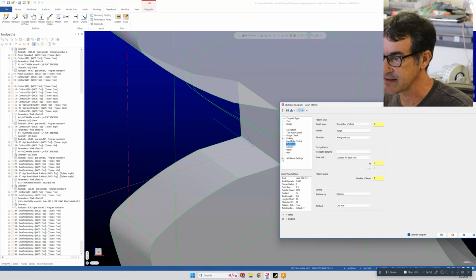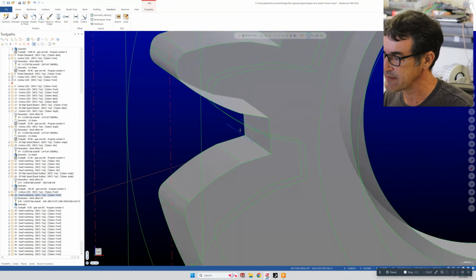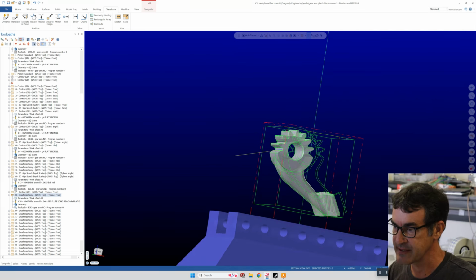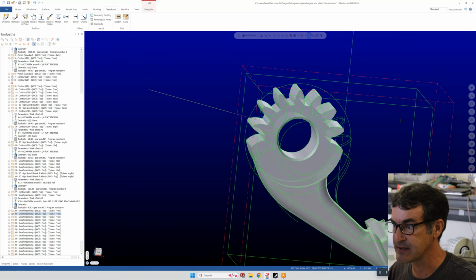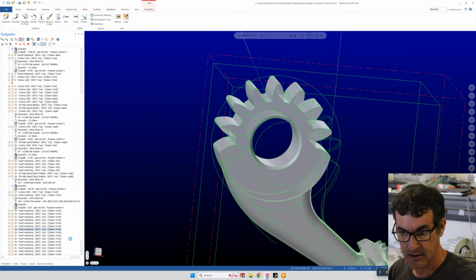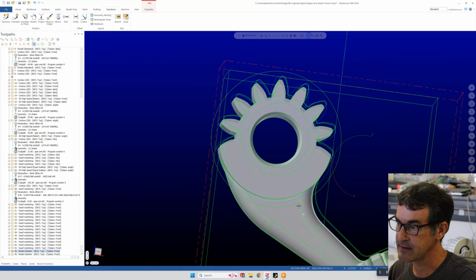And you'll see that there's not really planes, because in 5-axis, there is planes actually. But I guess it ignores the front planes, because in 5-axis swarf, the milling machine basically takes over and dynamically rotates everything around. But yeah, so we did one of those for each one of the gear tooth bottoms, the 5-axis swarf, and we can show that operation in the mill. So you can see we go around and we're cutting each side.